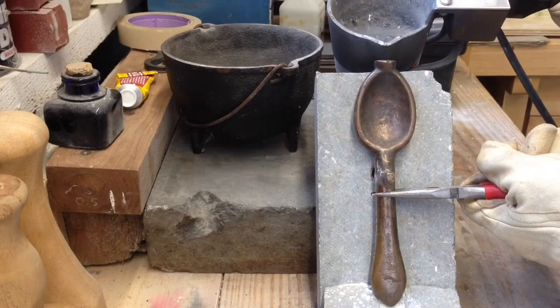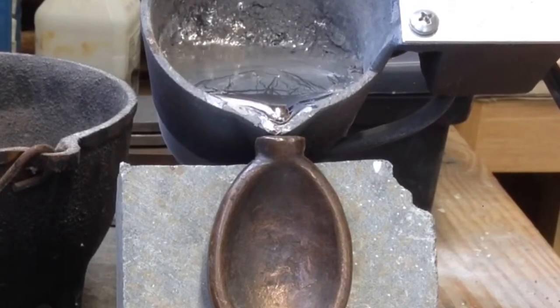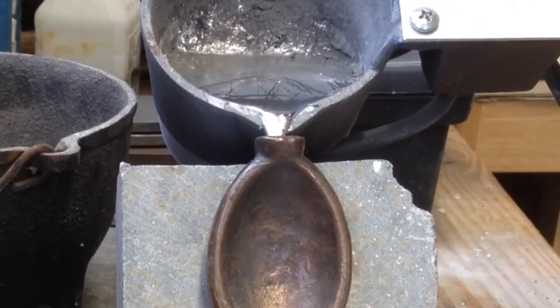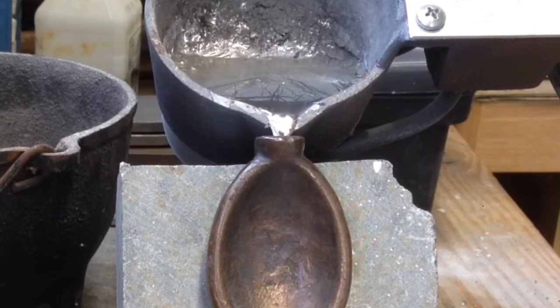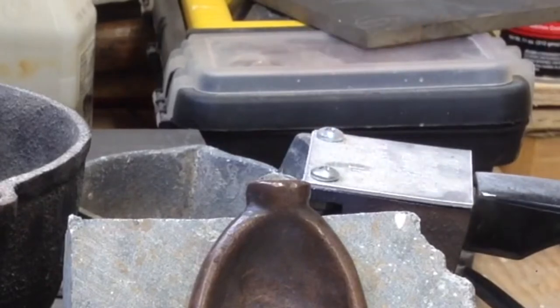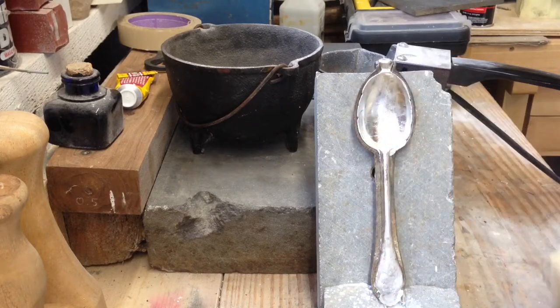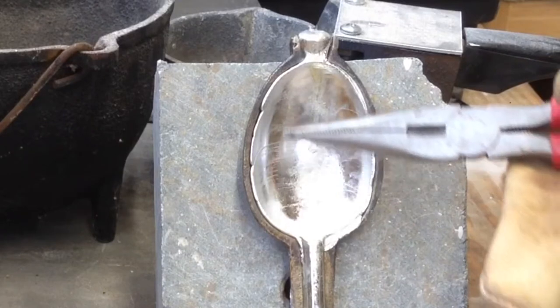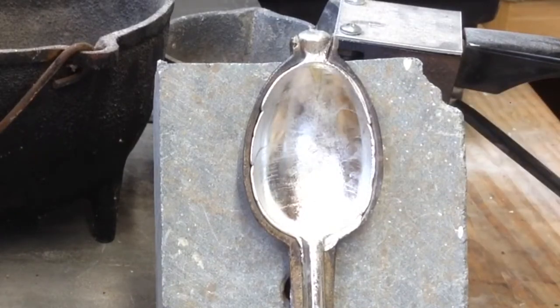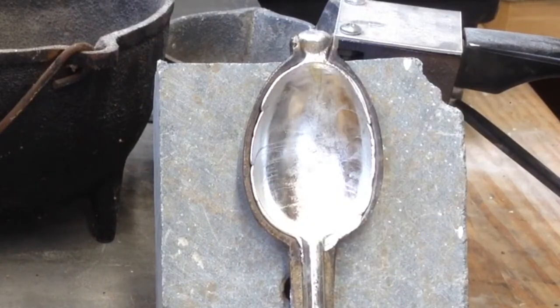Let's make a pour here. I try to go slow, let it fill up to the top and let the sprue come out just a little bit at the top so I can have something to grab hold of. So let's demold here. As you can see around the edges there were some incomplete sections. The first two or three pours generally are unsuccessful because the mold is still heating up, and that's okay.